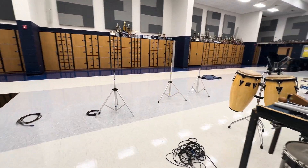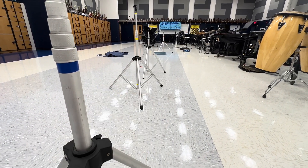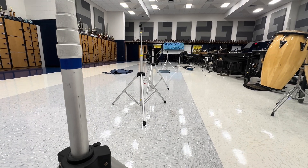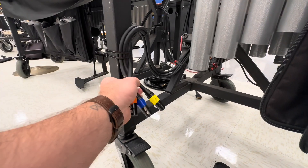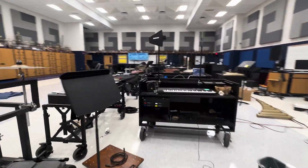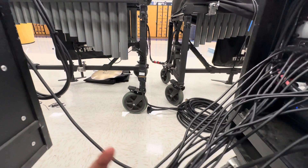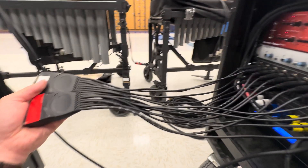You can sneak peek this with the stands — we're using four shotgun mics and I've got the stands color-coded. You can see the yellow and green on those and the orange on the one back there. The shotgun mics are color-coded, and once they figure out exactly where these need to be relative to Vibe 1, we'll get the cables color-coded too. The shotgun mics plug in right here on Vibe 1, and all of those go into a short modular snake. The mod snake from Vibe 1 meets here and jumps over — red snake is the pod with the three Marimbas and two Vibes, white is shotgun mics, two Vibes, and a Marimba. Those all go into the S32.